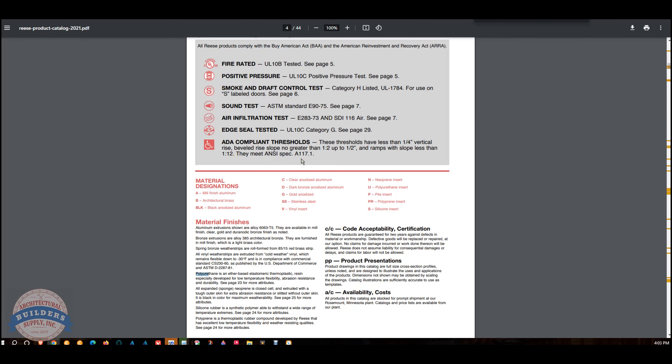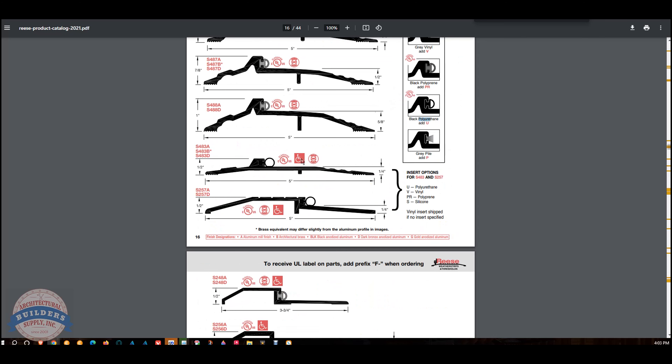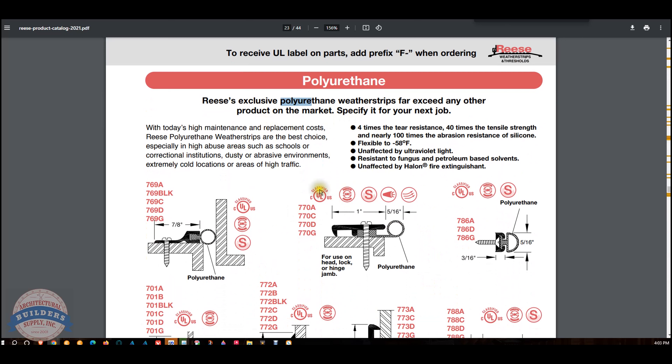What that means is, what is your effective undercut dimension? When I put my fingers on here and somewhat push it in, I can get it to move probably to within not more than an eighth of an inch before I would very likely start to strongly compromise the material. I would say no more than an eighth of an inch would I want to collapse this material. So if your undercut is three eighths, really at the most seven sixteenths would be pretty ideal for this. If you have more than a half inch, maybe nine sixteenths, maybe you pad the bottom of this down with maybe a piece of inch and a quarter or one inch wide closed cell neoprene that you can screw through and attach that way. That may work out really well.